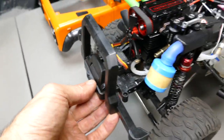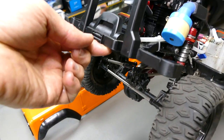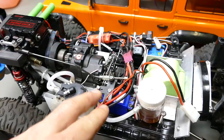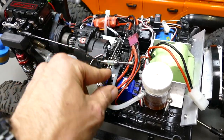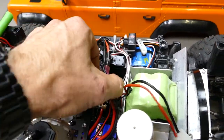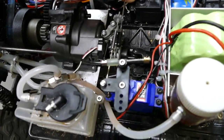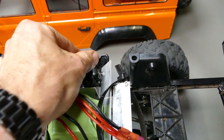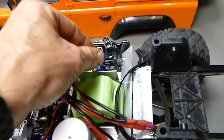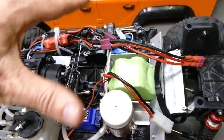The steering servo I've moved — I think it's a 30kg servo of my own and it works really well, no issues. The body fits perfectly. Moving on to the electronics: with any nitro you need a servo for the throttle and brake, obviously one for steering, and you also need one here for shifting between reverse and forward. The way the remote start works — I'll turn the remote on in a minute — is using this system here, which was the original way you started these, with this little servo tester. And that's another little servo just there.